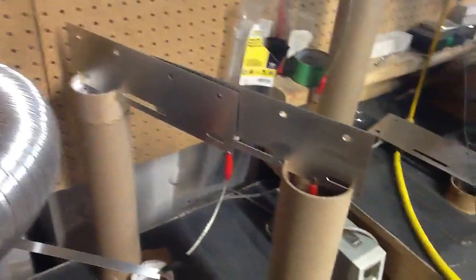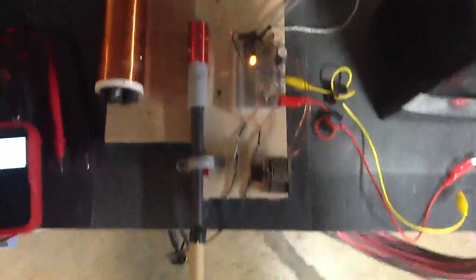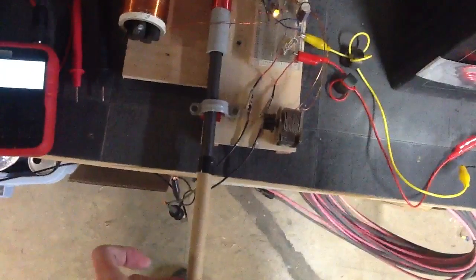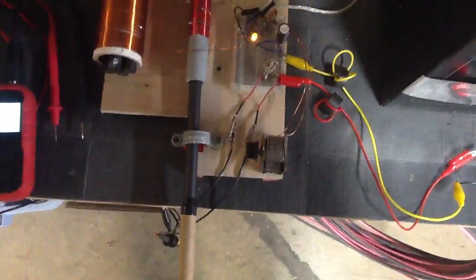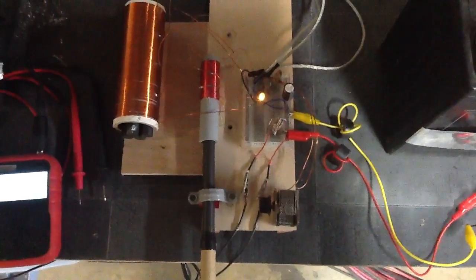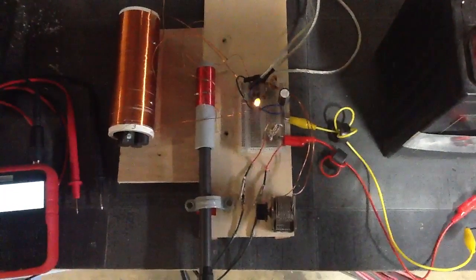Get some analog readings and see what that looks like. Everything's looking pretty good. I just wanted to show that kind of double plate idea — it seems to be a second level of tuning above being able to tune the feedback circuit. I've got this one really long ferrite, and that's really good for being able to stay away from the circuit, because with the smaller ones — I had some in here that were just two of them put together — and that would really mess it up when I get my hand right up close to it.